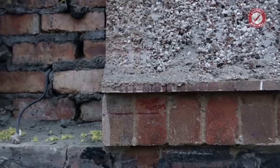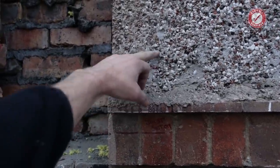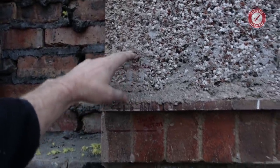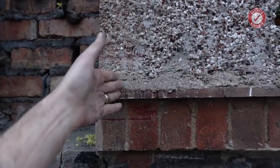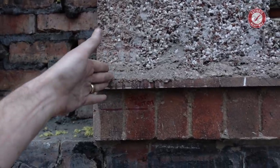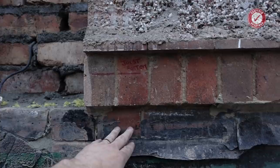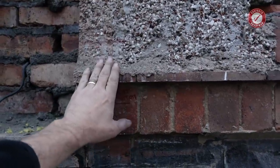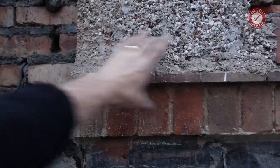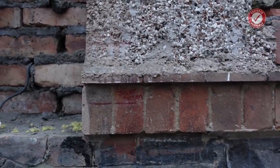Another job. But yeah, where was it? If that's the joist bottom and the joist top's up there, so floor level is kind of there-ish, then the end of the joist needs to be like here. So yeah, no, we don't need anything down here. What I need to do is smash out the edges of these tiles and bolt a ledger board along here. I think that's going to be the only way of doing it, really.